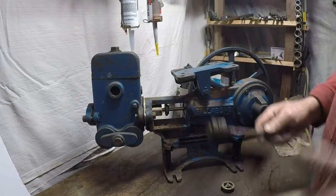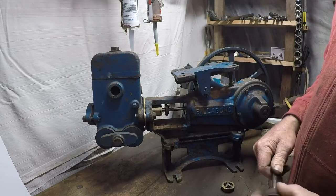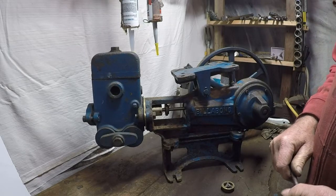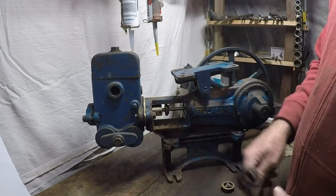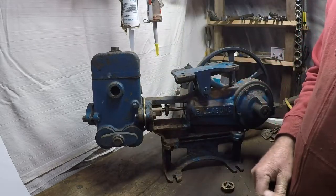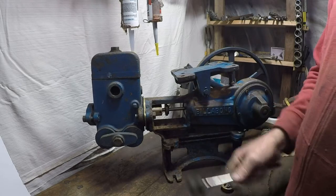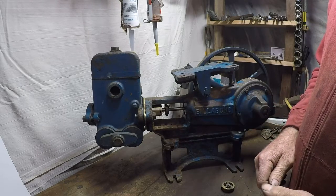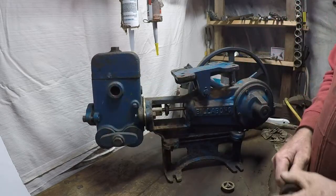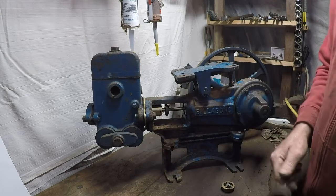I've found that a lot of the time, especially when they're on farms, you're going to suck up some rubbish into it. I've even seen a Banksia cone got stuck on the suction pipe, and that was it, end of the game. And the guy did so much work to try and fix it, and he'd fill the pipe with water thinking his valve at the bottom's holding the water. Meanwhile, it's a Banksia cone that's stopping the whole thing going.